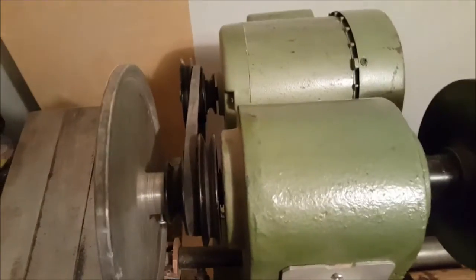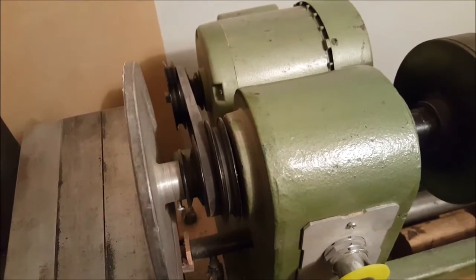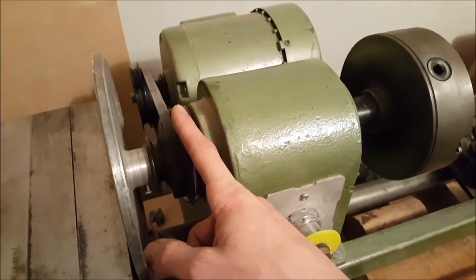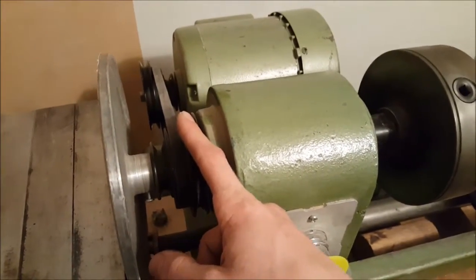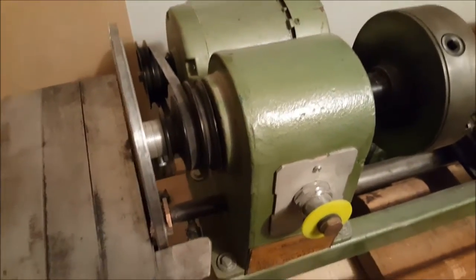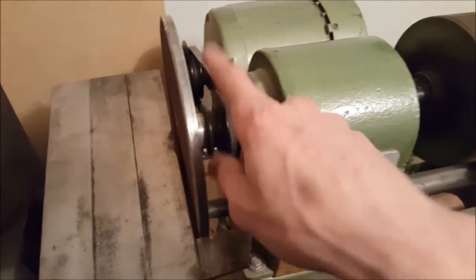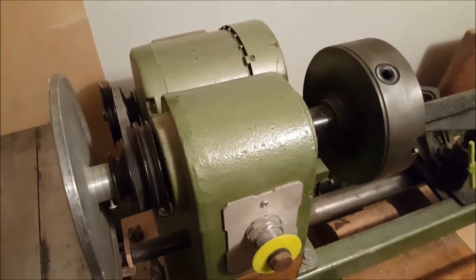So here's the chuck. For speed, I've got three speeds — I didn't calculate the actual speed with a tachometer. I tried the lowest speed first but there was no buildup of temperature on the tool or workpiece, so I went faster. I'm not familiar with the carbide bit so I'm keeping it at the middle speed.